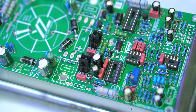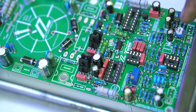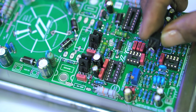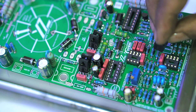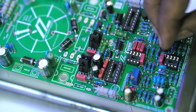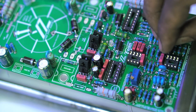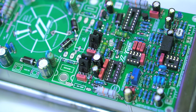For the LCR 0202, on this initial PCB there is an error in the LED pin placement due to the EasyEDA library used. However, I have marked the LED plus and minus pins, so if you want to build it yourself the LCR will be easier to install. The next PCB revision will correct the pin position to match the LCR 0202 component.